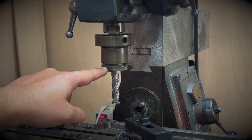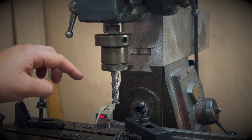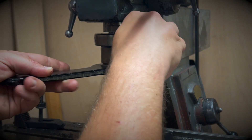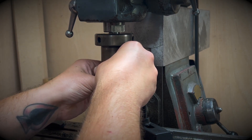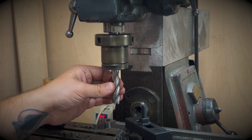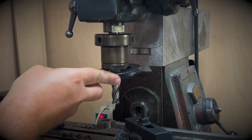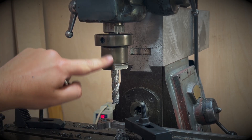I must point out — this is wrong. This is what the chuck looked like when I was machining these rods. There was vibration, and I assumed it was because the rods are only pinned at both ends, but actually this is not the way to do it. Mid Engineering — I think that's the chap who has a video — suggests the correct sequence is: loosen the cutter, snug up the screw thread up to the chuck finger tight, then screw in the cutter, and then tighten up the top. Apparently that is the way to ensure it stays nice and rigid throughout.